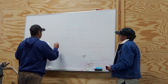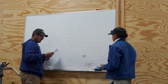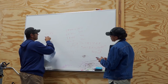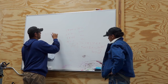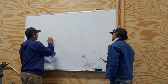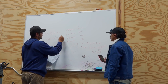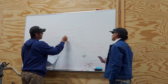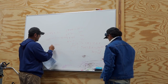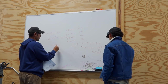So the slab — let's do the slab. The slab is 3,273 square feet and it's four inches thick. So 3,273 square feet times 0.33 feet equals 1,080. 1,080.09 divided by 27 is 40 — so the surface is 40 yards. And the beams we have 70, so it's 110 yards total.